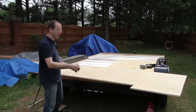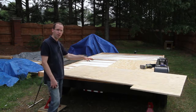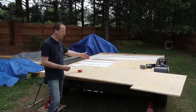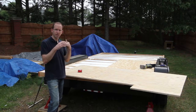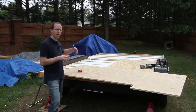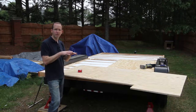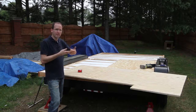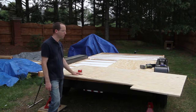Because this is an eight-foot wide trailer and these boards are eight feet, you may want to consider running boards parallel with the joists. However, be aware that tongue and groove boards are four foot by eight foot, and when you put two four-foot pieces together they don't make eight feet — you actually lose about a half inch due to the tongue and groove. That means by the second joint the alignment can be really far off. Also, if a joint is a little off a joist, it can be hard to fit the tongue and groove pieces together. So I prefer to run boards the way they were intended — perpendicular to the joist.